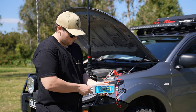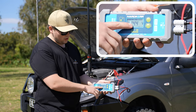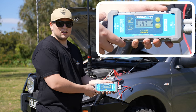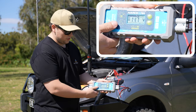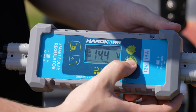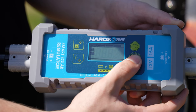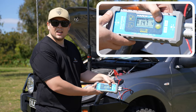Plugging the unit in, we can see it does a little startup, recognises that we're getting power from the solar panels, and then you can see it automatically spiking the voltage all the way up to 14.6 volts. This unit is currently set on wet battery mode because I do have a flooded lead acid battery as my start battery. If you need to change the battery type you're trying to charge, press and hold the type setting — it will start flashing, and down the bottom you have your options: calcium, LiPo, gel, AGM, or wet cell. To select, just hit the amps or volts button again.